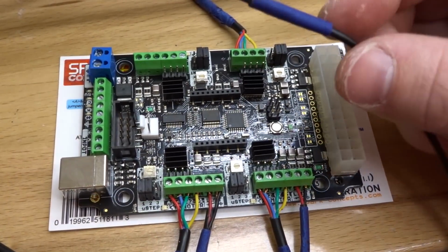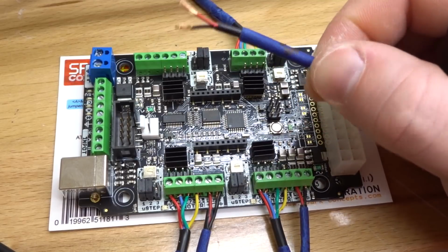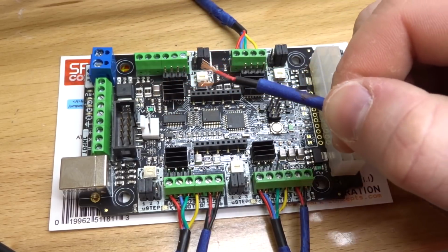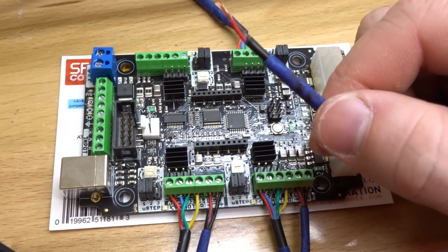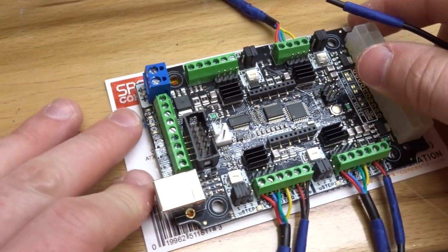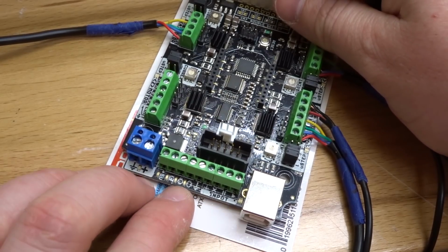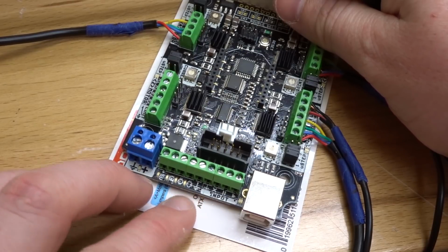So if you remember from the previous steps, we have labeled this one SL for signal laser. So this is going to connect to our controller board. The other two conductor wire will connect to the power supply. So we need to make sure to connect this to the proper sections of our Xpro controller board. So here on the output section of the controller, you'll see an M for the motor, and you'll see this symbol here, which stands for the ground.